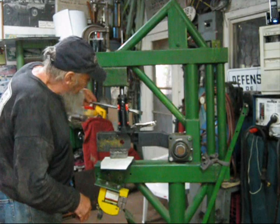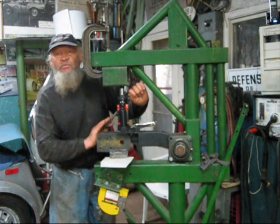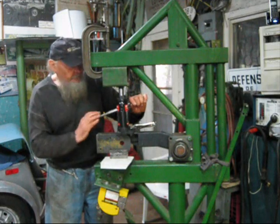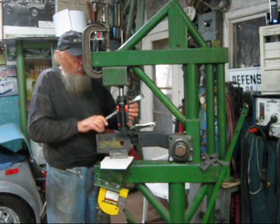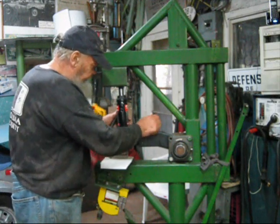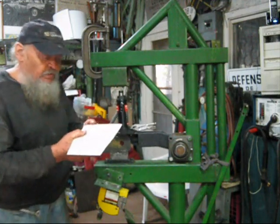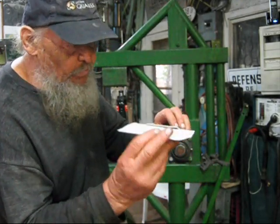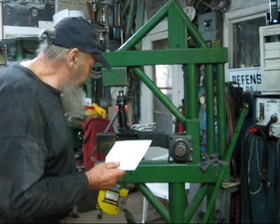So here I am closing this, and all it takes is just this. Did you hear that? So it is cut, clunk, but now I'm just giving a little more pressure to form a louver, okay? So now I'm releasing pressure on the jack, lifting it up, and can you see this? This is the first louver, okay? Can you see? Yes?